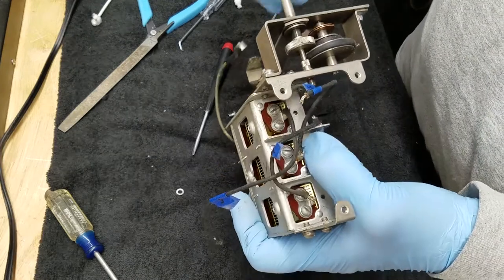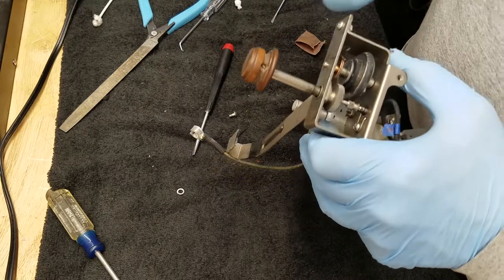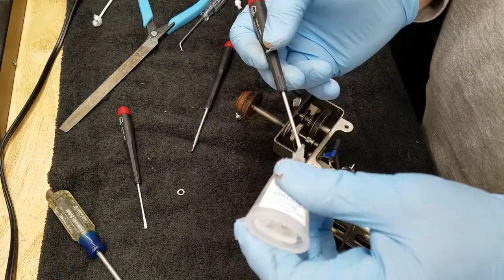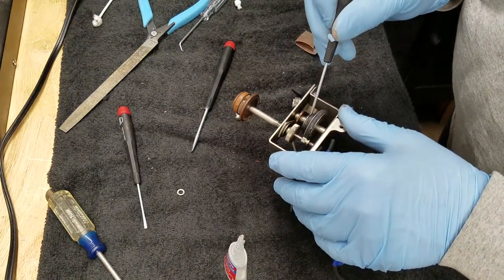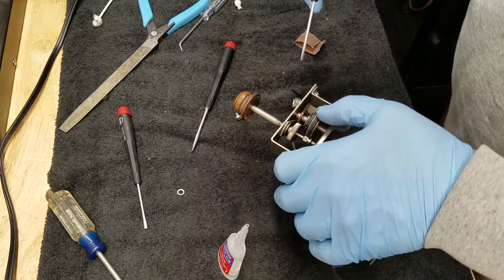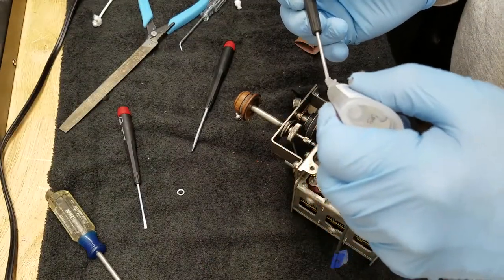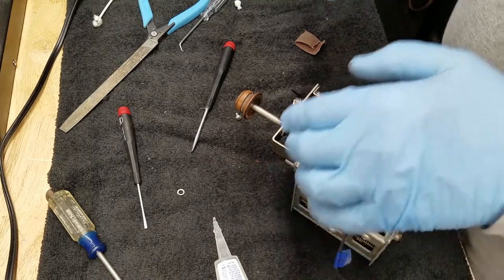I think we've got this thing nailed. What I'm going to do is put a little drop of superglue along this edge of the coarse rubber wheel, and then slide that wheel toward the front. If it doesn't hold, it doesn't hold — it's not the end of the world, I'm going to try it. It's sort of like putting oil on a tuning condenser. I just want to get down here along this side, put it in two or three places, and slide that rubber band here just toward that flange. If it doesn't hold, I haven't really lost anything, but if it does hold, it will maybe give me better engagement. What's happening is it's running up into the grooves of those knurls. So I'm going to wipe off my screwdriver.